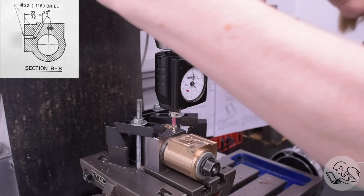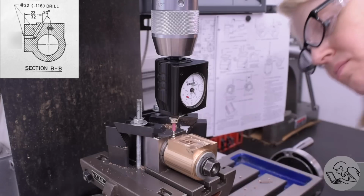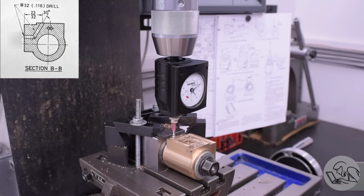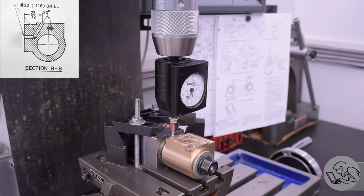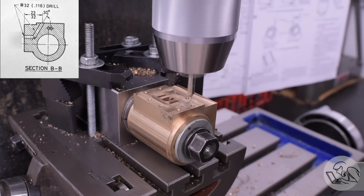The good news is that, like those steam ports that were also missing a dimension, the exact X position of this steam channel doesn't matter that much. Like, you have a pretty generous target to hit with that other steam passage. So as long as we are sure to get the angle correct and we miss cutting into the bore in the center, then we'll be okay.